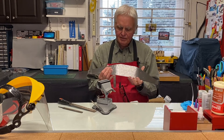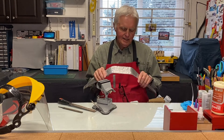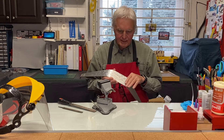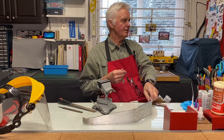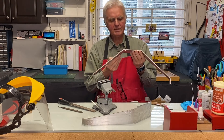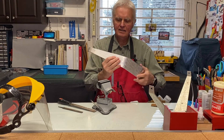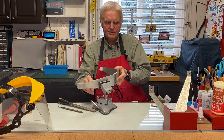The one thing I have to do differently is that the pliers and tools I used had teeth, and of course aluminum being a softer metal it left teeth marks on it. I'm hoping to dress most of that out because I'll give it a swirl pattern. You can see the original was dressed up with swirl marks, and the original edge had a smooth edge here but I had to cut this so the blade left some marks, which is understandable.